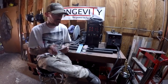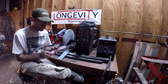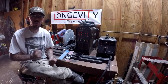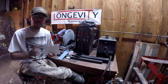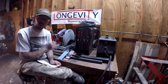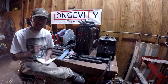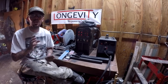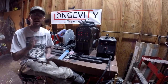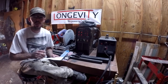Tungsten comes in different colors based on the type of material it's made of or has in it, and it also comes in different sizes, so you need to find out which size works best for your application. Here are some approximate numbers as a starting point: with 1/16 inch tungsten your max amperage is about 100 amps; with 3/32 inch your max is about 250 amps; and with 1/8 inch your max is about 400 amps. You don't want to push those amps too much, because that will cause your tungsten to deteriorate.